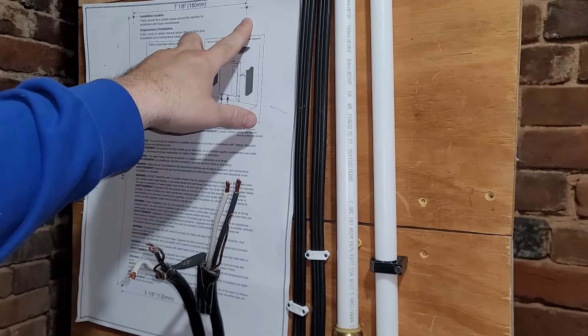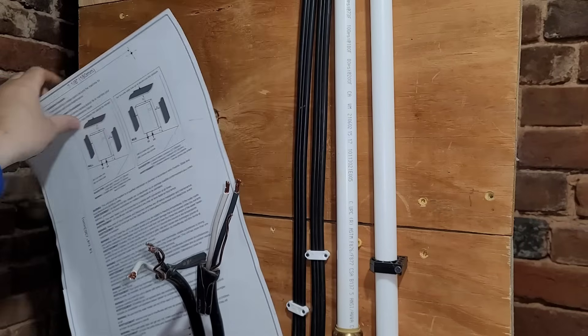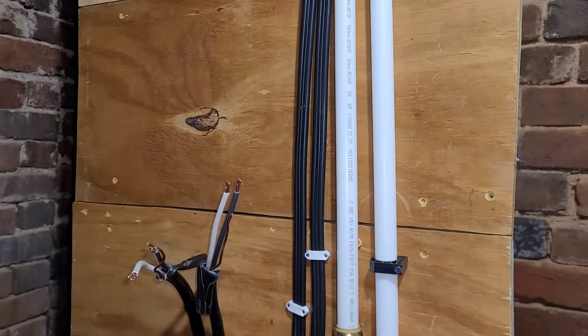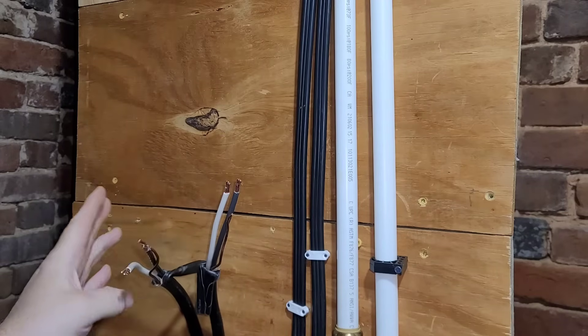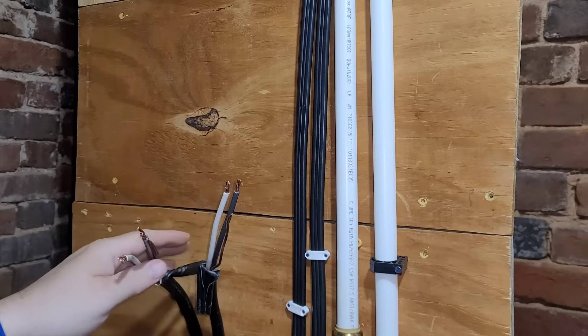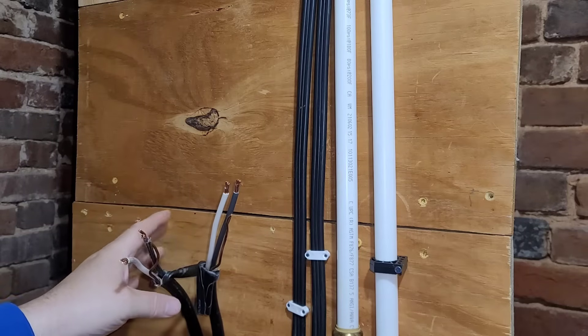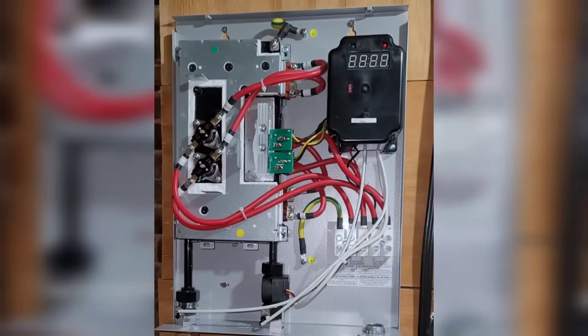You can see my wires and pipes — none of this is live, of course. I spent about $200 on 8 AWG wire and about another $100 on the circuit breaker, so that's something you'll need to factor into the overall price. Let me put my screws in and hang up our water heater. Here we are — up and ready, installed. I had to do this in portrait view because landscape couldn't capture everything, and now I'm going to set up the plumbing and check for leaks before installing the electrical.